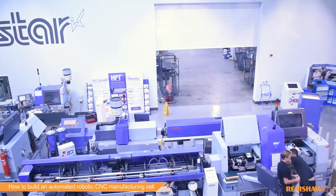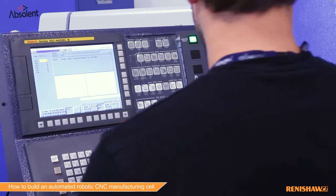The ability to run lights out for longer periods on more challenging work pieces that would suffer from tool wear — we can cater for that with the automatic tool offset system that feeds back all those small adjustments back into the CNC control.